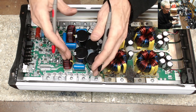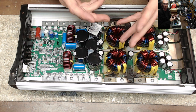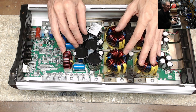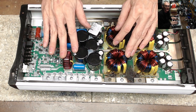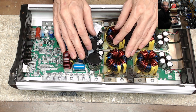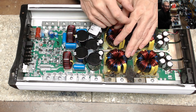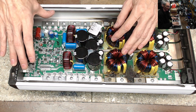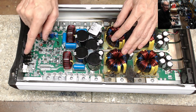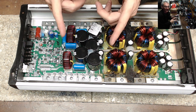More times than not, when I read the 9.9K across the amplifier, these things fire right back up. That's really what I wanted to go over today — the process of recognizing what I need to do on an amplifier and recording what your values should read on an output section. I got an email over the weekend about someone with an MD8K that starts up but goes into protect — that's an output short potentially. I need to know what the resistance value is to tell you if you have an output short on the transistors or drivers, or if you have a preamp short.